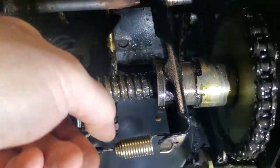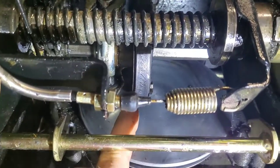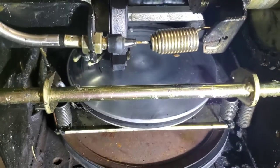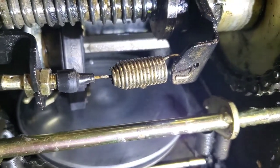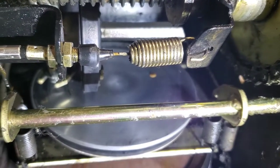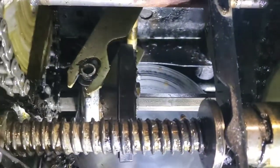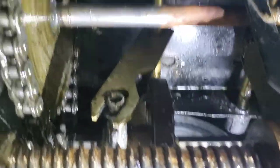The speed adjuster is this guy right here. It's got a bearing in it, a couple of thrust washers on it, and it brings the wheel along onto the drive disk. My drive disk is in beautiful shape. I believe this is the original wheel that's worn out, so we're going to change the wheel. That little primary sprocket runs a chain through this big secondary sprocket, over to this primary sprocket, through this sprocket that drives the axles. So there's your gear ratio, your reduction.